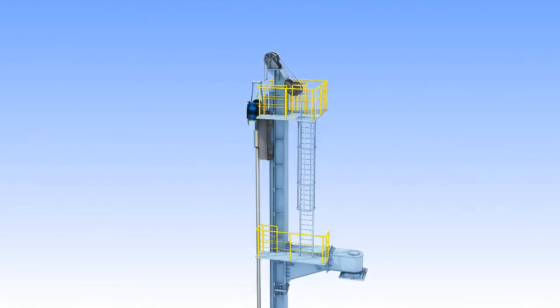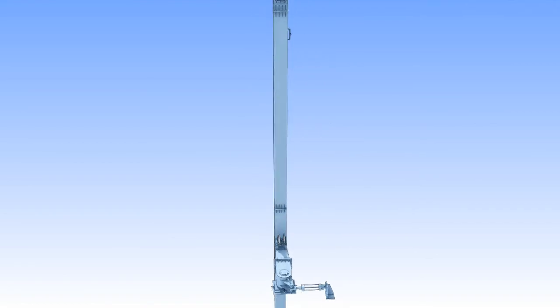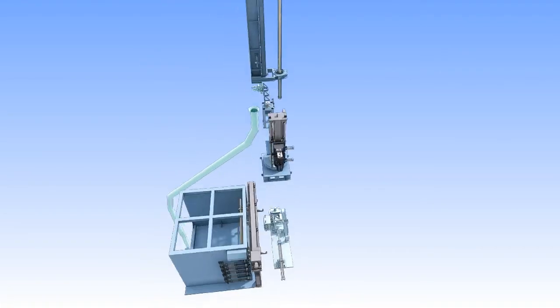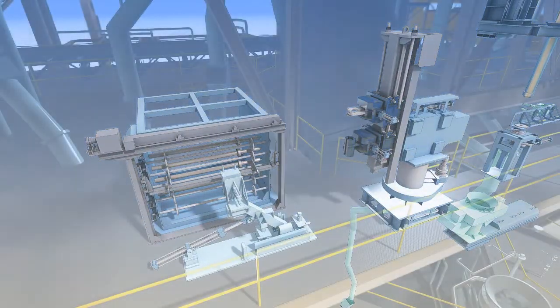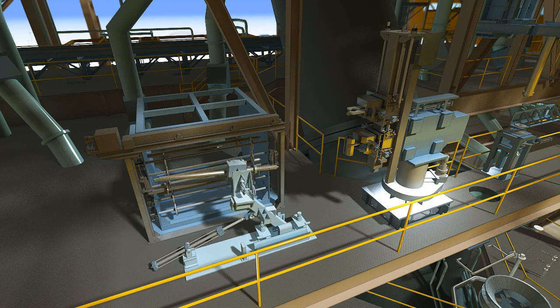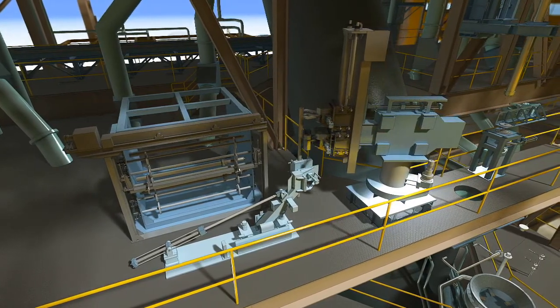The impurities inside the hot metal are removed during blowing, but to accurately predict the target temperature and the endpoint oxygen according to the steel grade, the ingredient is measured using a sublance at 80% of blowing. Sublance measurement is implemented by four types of probes in the storage rack. If the probe intended to be used is selected, the probe lifter begins to operate and moves the selected probe to the probe erection frame.